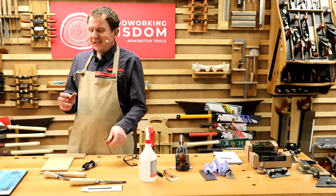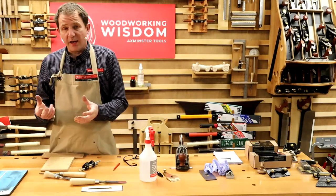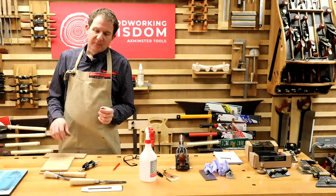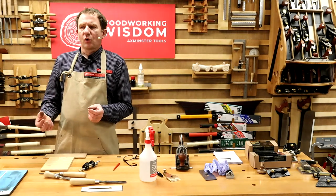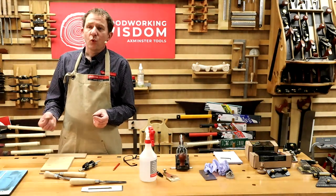Okay. Need to keep it clean is one thing. Depends what you're using as a lubricant. Water can be really good. At the end of the day, clean it, wash it off. You can use the diamond lapping fluid. Is that good? That'll help clean it out. That's really good. If you leave the material on there that you're cutting, yes, it dries and it clogs the paper. Soapy water will help.